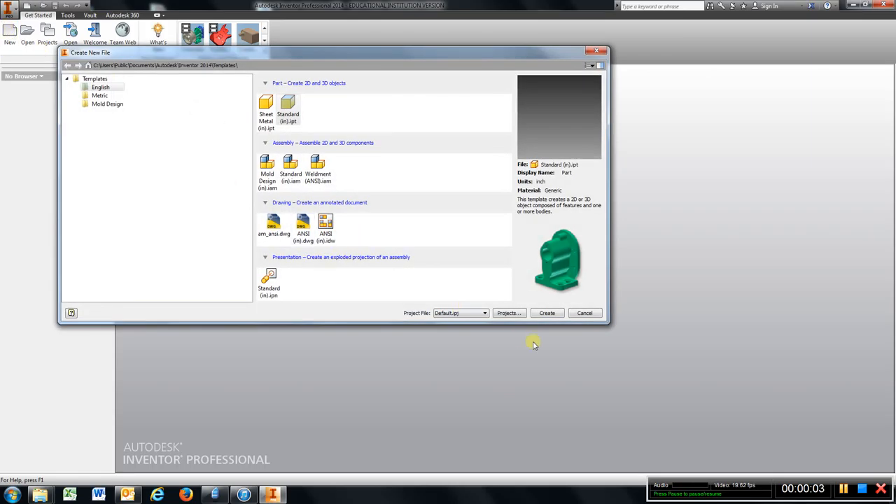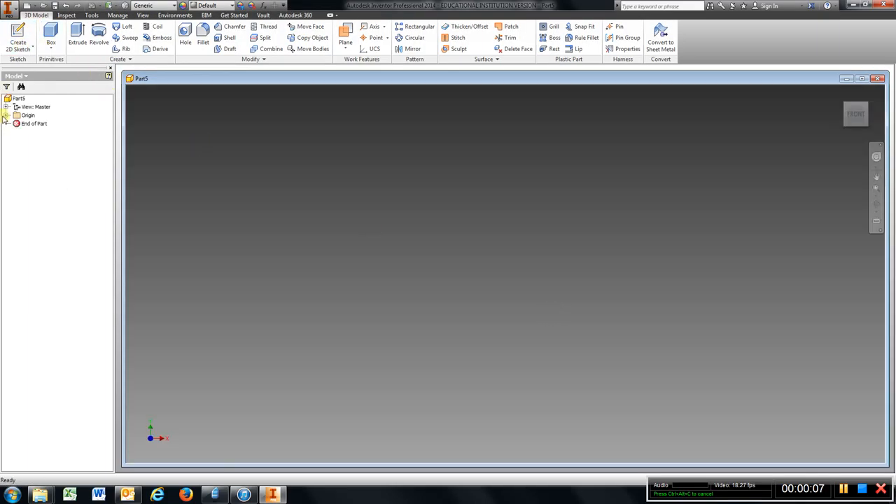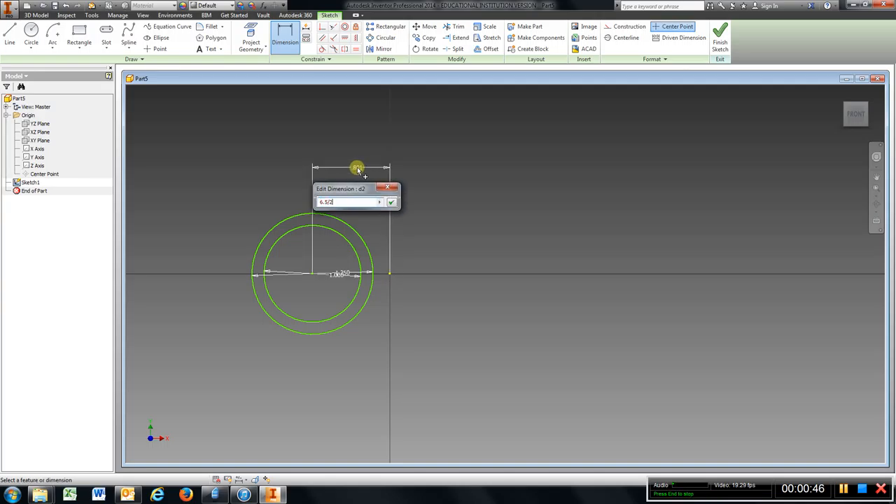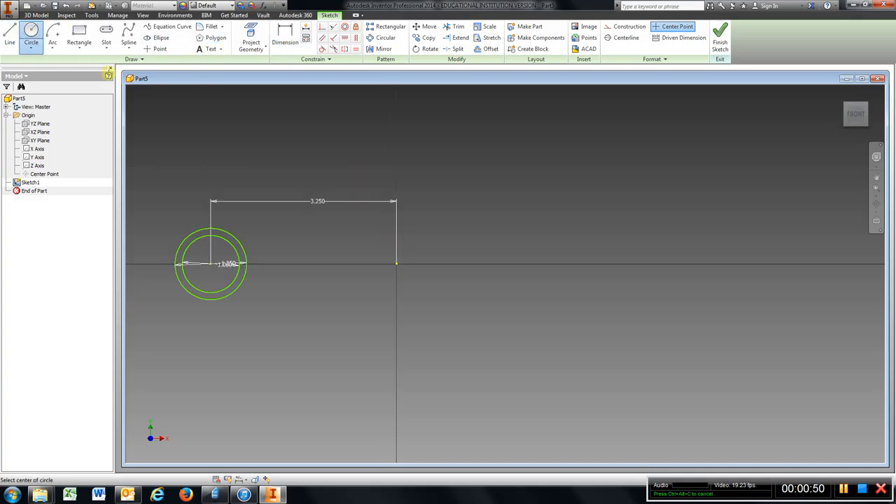Video for 7.3. We are going to start out looking at these circles. On the left I have one at 1.25, and the small one is 1, and the overall is 6.5. I'm going to dimension center to center — 6.5 divided by 2 — and I'm going to draw the circles on the right, which are a radius of 1.